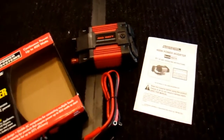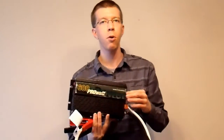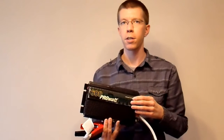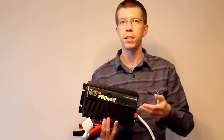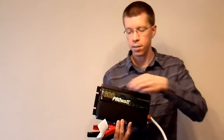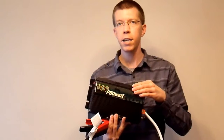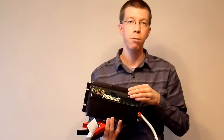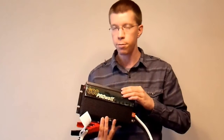Now let's move up to something just a little bit larger. Inverter number 2 is the Xantrex ProWatt 600 watt inverter. Now I had done an entire video review of this earlier, so if you're interested in the details, go ahead and check out that video. But I'm just going to quickly summarize. This is advertised as 600 watts. In reality, I tested and it does about 700 watts continuously without overheating at room temperature. So that's pretty good for a 600 watt inverter.